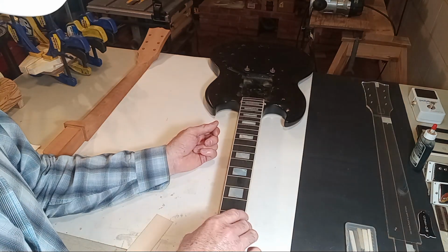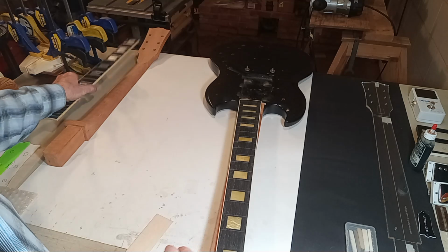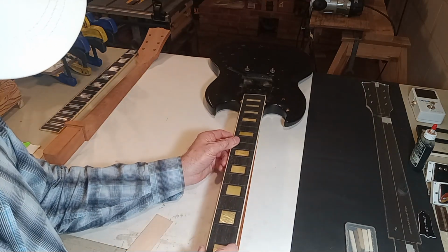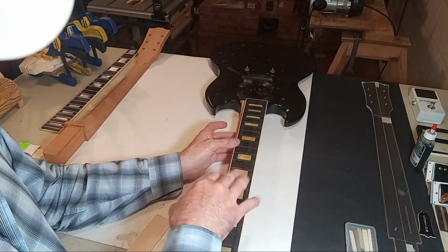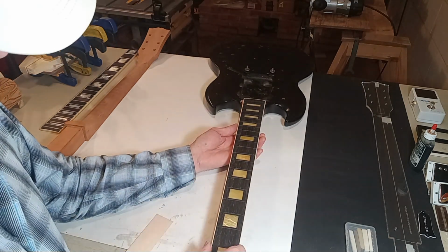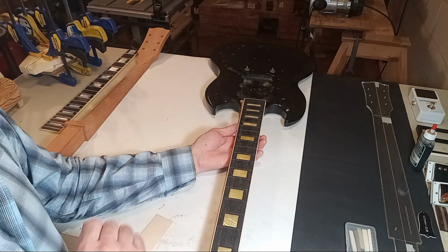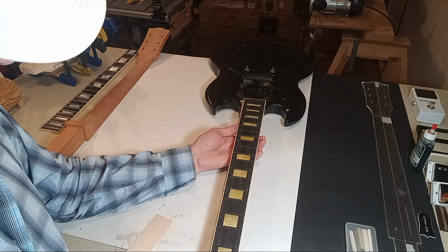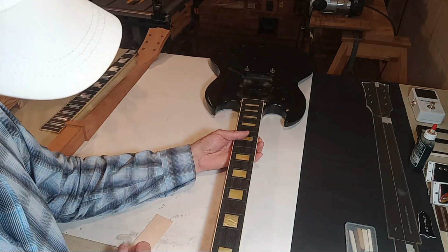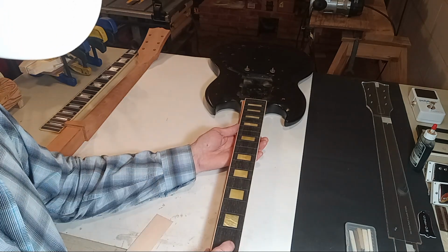Okay, but the worst thing that could happen, well, I won't talk about horror stories, but if you've spent this much time, you're going to know the importance of guaranteeing that you don't just put this up here and start loading it full of clamps, especially if you're working with epoxy, because that stuff will creep. It'll creep at like 2 hours later. You'll come back and this will have moved. So when you're doing epoxy work, you got to stay with whatever project it is that you're epoxying and truly monitor everything to make certain that you don't have creep.